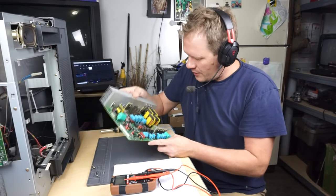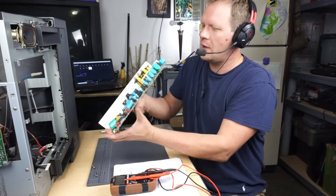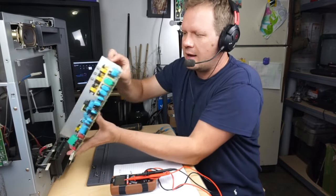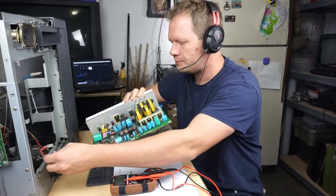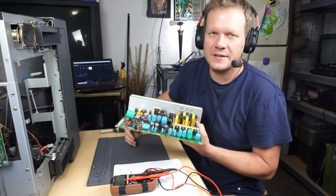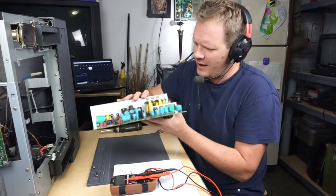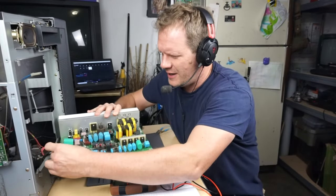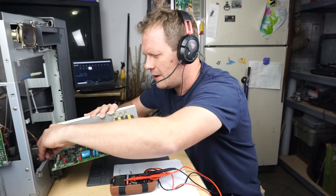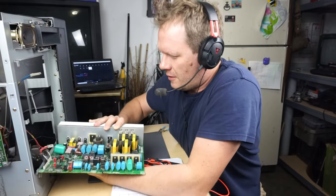The last thing I want to do before I move on to the next board is I'm going to hook this back up into the monitor frame here, just the way it goes like that. There are only a couple spots to hook up. We'll put the screws back in and then we'll turn around and run a quick test to make sure it powers on and that there's no issues with what we've done to this point. Let's go ahead and get this reconnected, reinstall our board, and run some tests so that hopefully everything went good on this board rebuild.